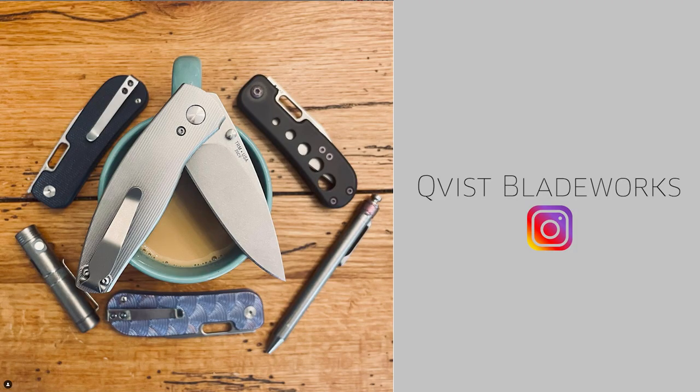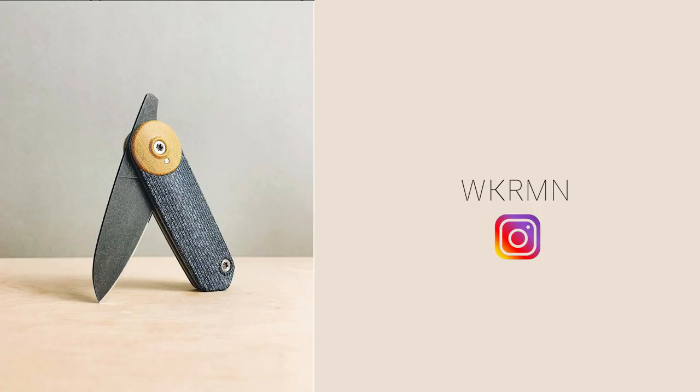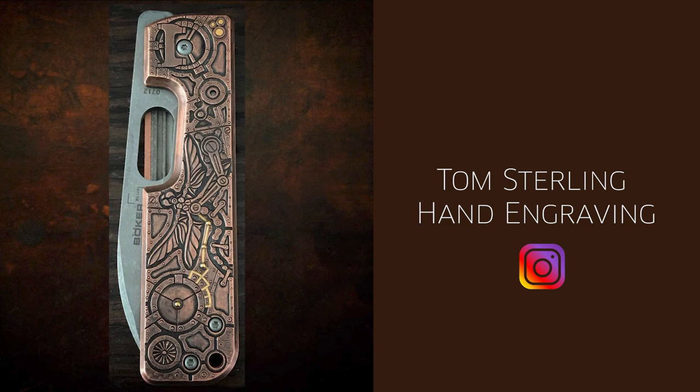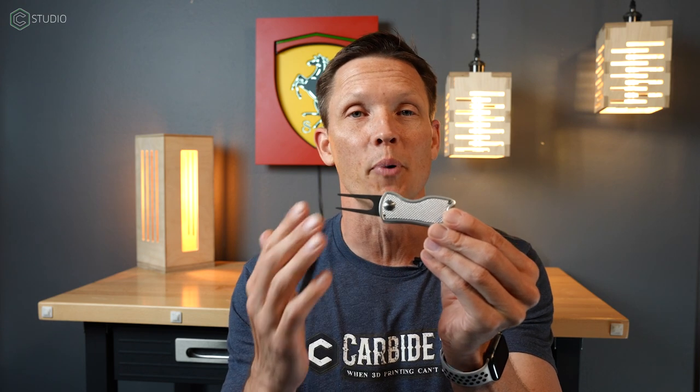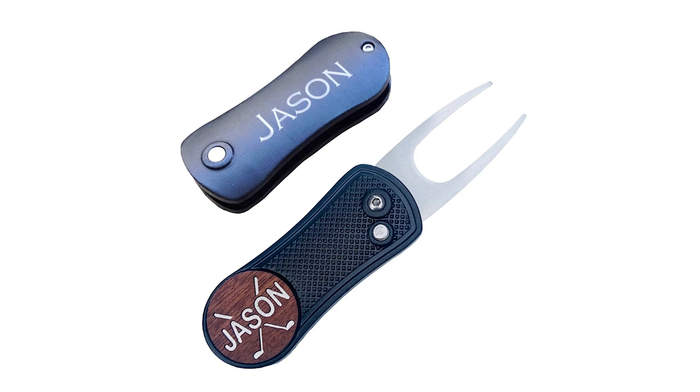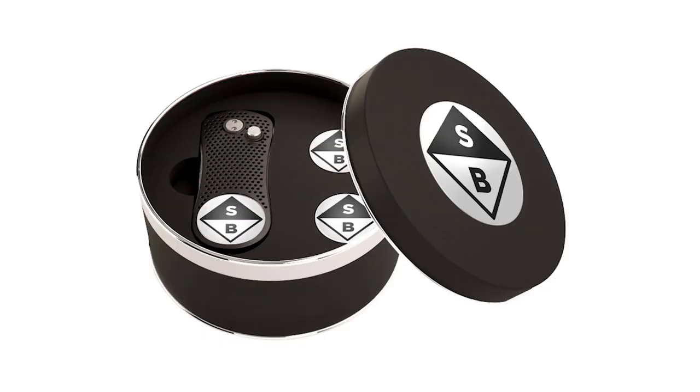It doesn't take a whole lot of machining prowess to produce something pretty cool. With this divot tool, you might notice its similarity to a knife. Go ahead and treat it as such. People make tons of money with custom knives. This is just another opportunity to take that same form factor as deep as you want. Start making scales for either side of this tool. Disassemble it. Utilize the mechanism that's available for $4 to $6 and add on to it. Go ahead and machine away the knurling on this particular model and create a flat area for you to polish and then engrave. There is so much possibility in this project. This one, just like the simpler version, contains a magnet for a ball marker. You can inlay one with one of your custom markers and now you're selling two items instead of one.